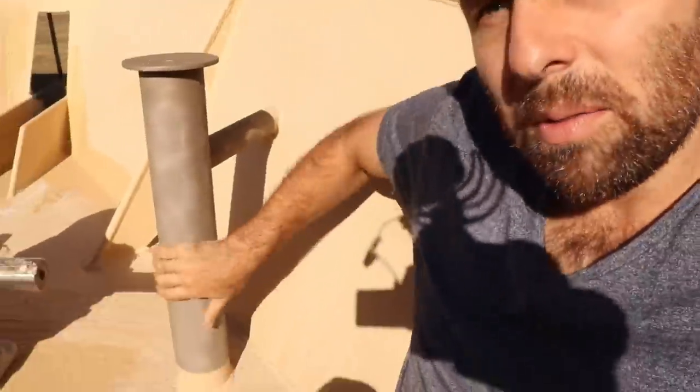I'm also going to put a grease nipple into it and essentially fill that bottom, this here on the crane. I'm going to fill that up with grease so that, A, it prevents any rust down on the bottom where the stainless is welded to the mild steel, but also it's going to make everything slide a lot easier, and that plastic will hopefully act as a washer that'll stop a lot of that grease just spurting out all over the show.